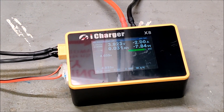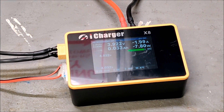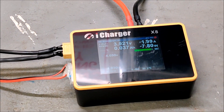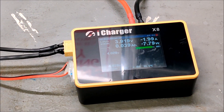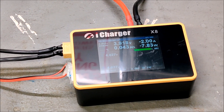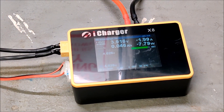Don't make my mistake and accidentally enter LiPo instead of LiFePO4 in the charger. I just charged this battery to over 4 volts, and this is supposed to only go to 3.6 volts. So now I have to run a discharge cycle and get these down under 3.6 volts. Hopefully I haven't done any damage, although I probably have done a little bit of damage. But the cells aren't too swollen, so don't do what I did.